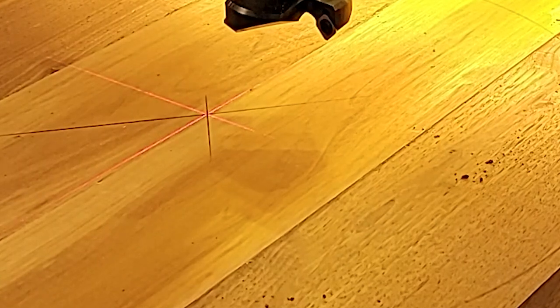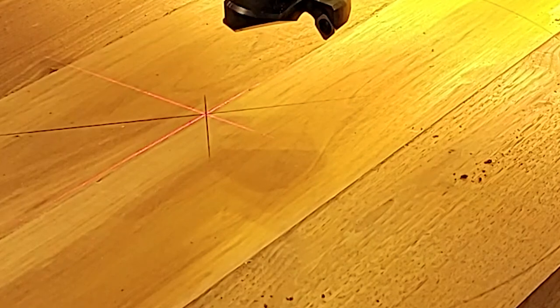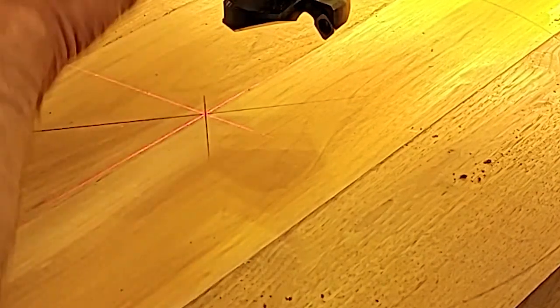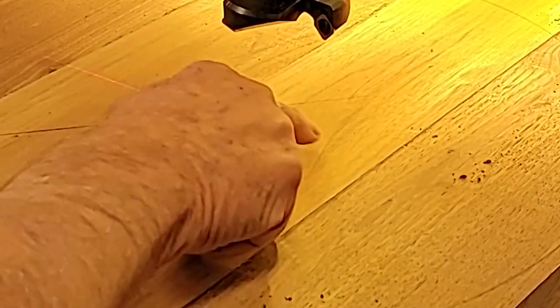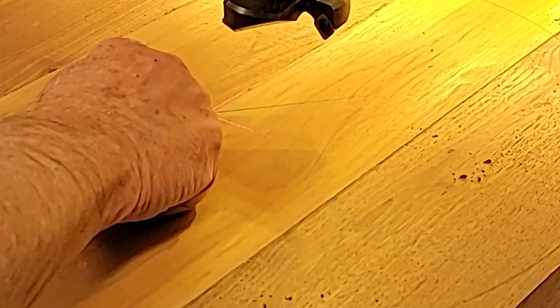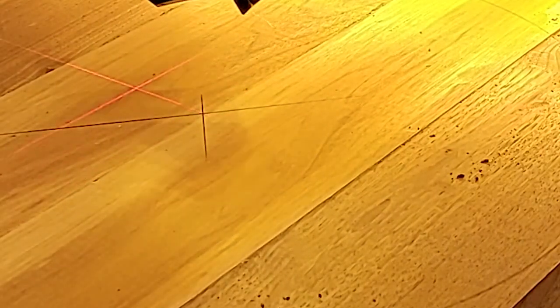And in my Mach 3, I've got a button that I programmed that it'll do the offset. So here's where the laser is coming down. Of course, here's where the center is. But when I press the button, it's going to bring that over dead center. So now I know I've got my X and my Y perfectly zeroed.